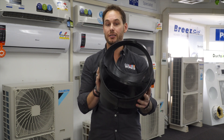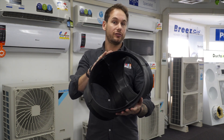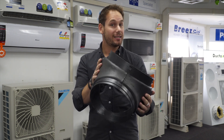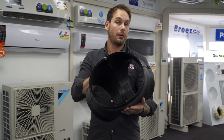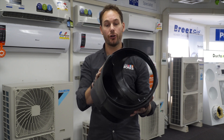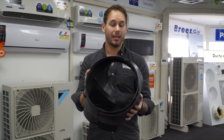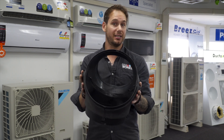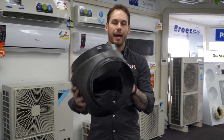Our main concern with branches is the plastic ones. The issue with plastic ones is that over time they tend to warp and bend, and if you have any issues in the future with tradies up in your roof stepping on these, they can crack and break, causing air leakages. Typically you don't notice if your system has an air leak until it's too late. So something to really watch out for is your branches — at Gasworks, we only quote the metal ones.